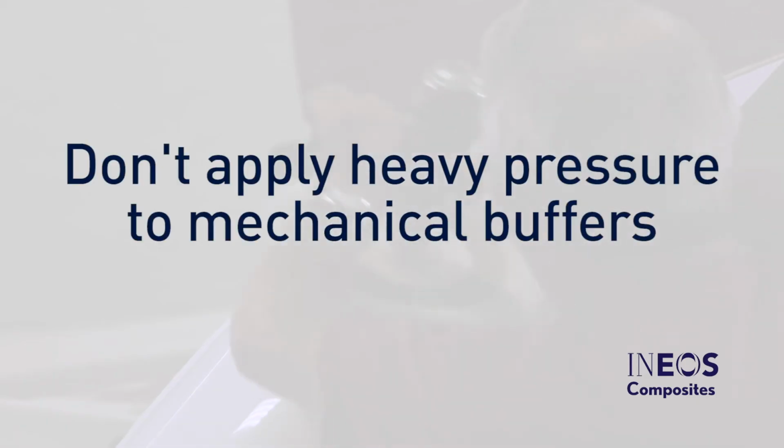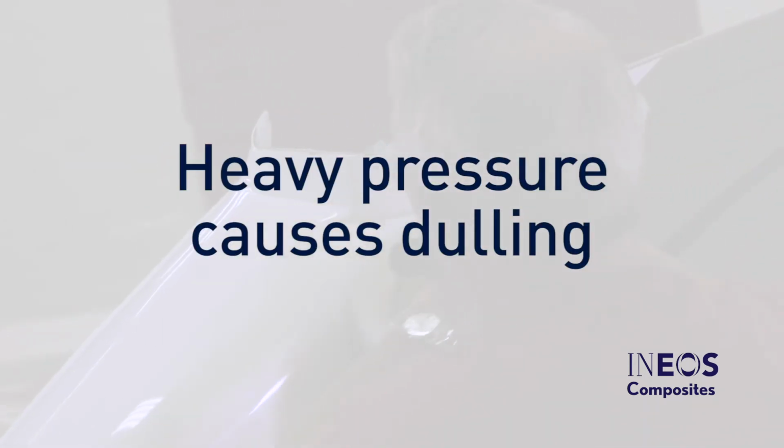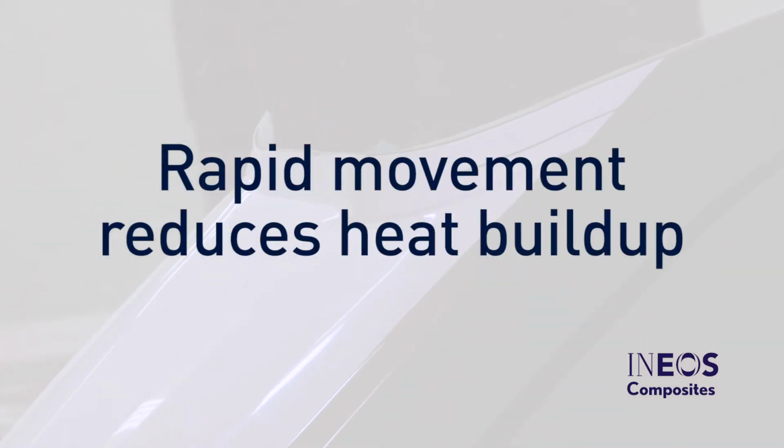Be careful not to apply heavy pressure on the buffer. When heavy pressure is applied, heat is generated. This heat will dull or blush the entire surface as well as the patch. Keep the buffer moving rapidly over the surface to avoid hot spots.